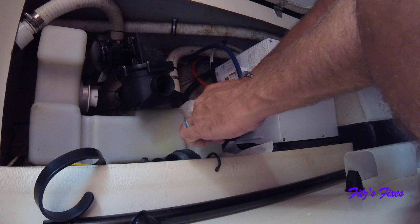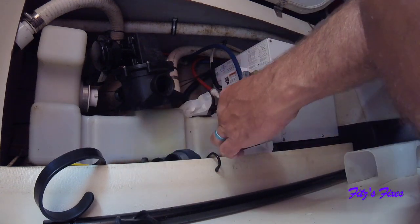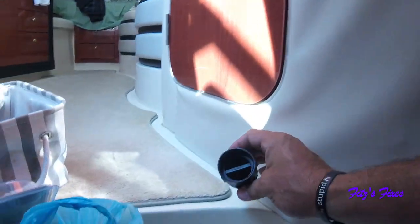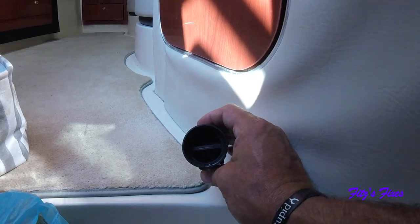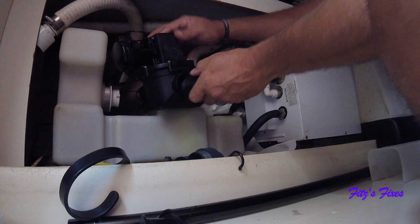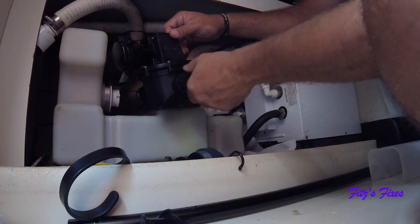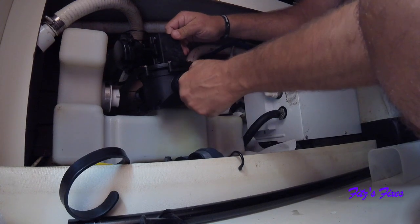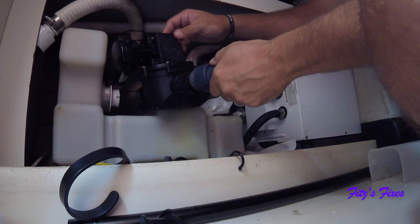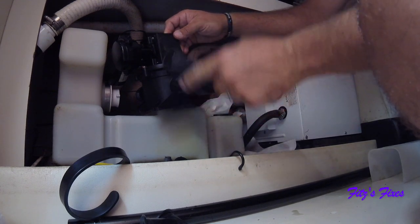Let's get this one out and put the next new one in. See how it's closed? Yeah, that's how you want it. This one screws in here. You don't have to go crazy when you tighten these things - it's got a rubber seal against it. You just want to tighten them kind of like you would tighten a fuel filter on a car. Don't use a wrench or anything, just tighten by hand and snug it down - that's all you really want.